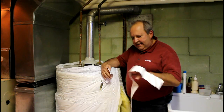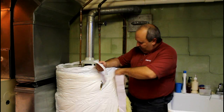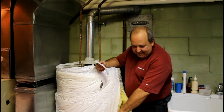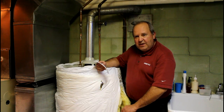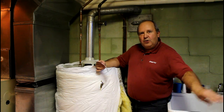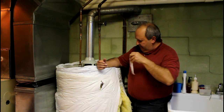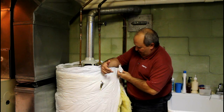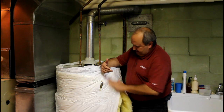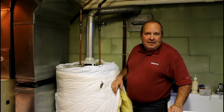The tank's wrapped. The blanket came with this long strip of tape for us to seal up seams. We cut a six-inch piece because we're going to put it across here to hold things. I'm only going to put the upper one on right now because we've got to get that bottom cut out so it fits right, but I want this one to hold everything in place so I can cut out around the gas area and bring it all together. Just got to be careful that the backing doesn't get stuck — I'm holding this with my arm and I'm just going to get this across the first seam. Now I can step away and work on cutting away the rest.